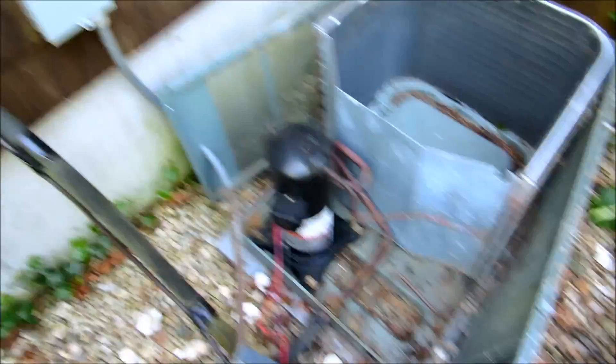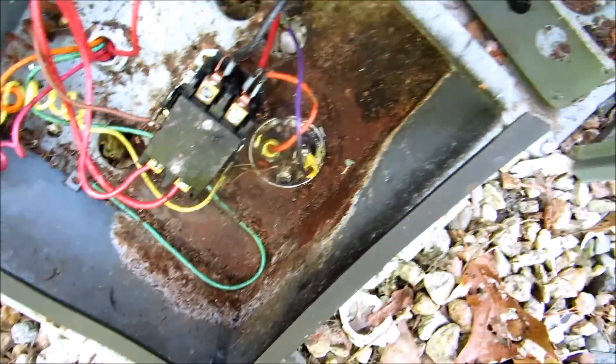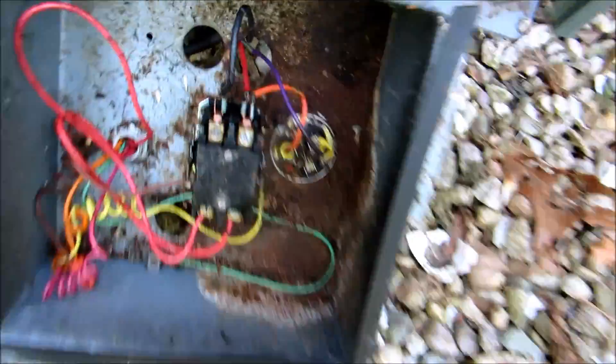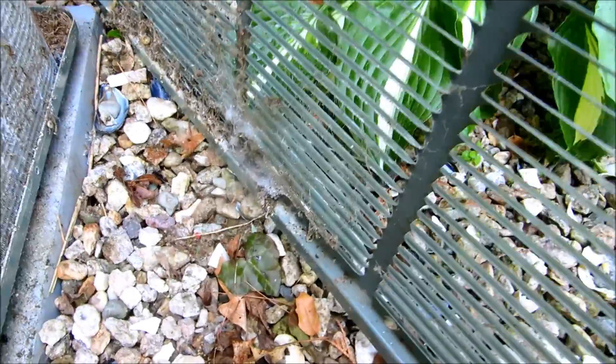Half the flipping returns is what I'm looking at all the time, so yeah, my suction pressure's low all the time. It's the guys that install this stuff up here. Anyway, hopefully you enjoy the video. Annual cleaning — I'll get this one apart, disconnects off. He's got a mouse problem in here; he keeps putting WD-40 in here. He's gonna put some electrical putty in to block off the holes. I got the cabinet apart — there's some stuff in there.